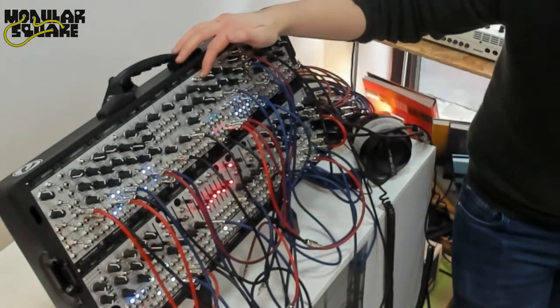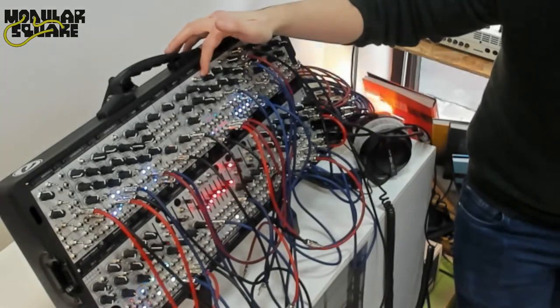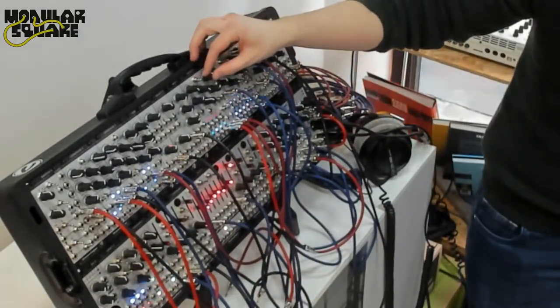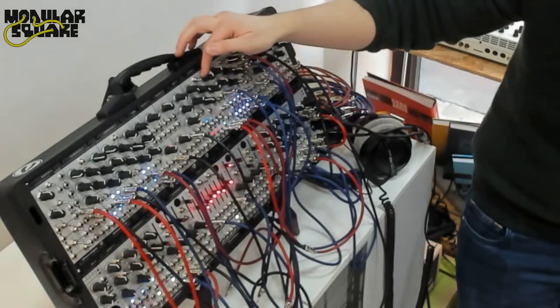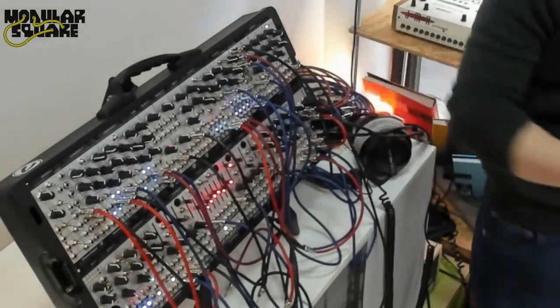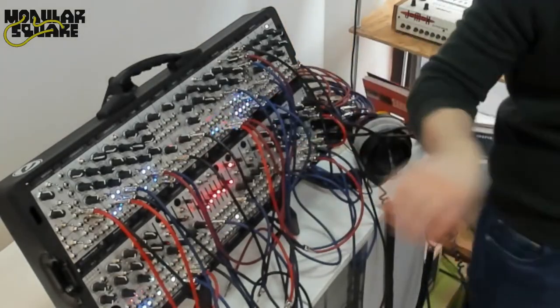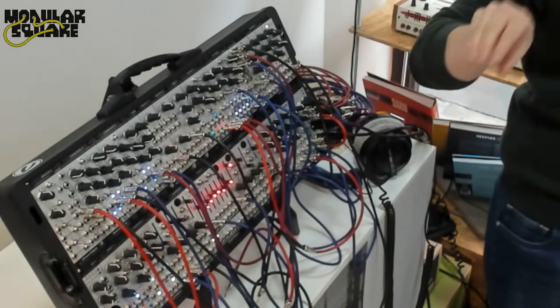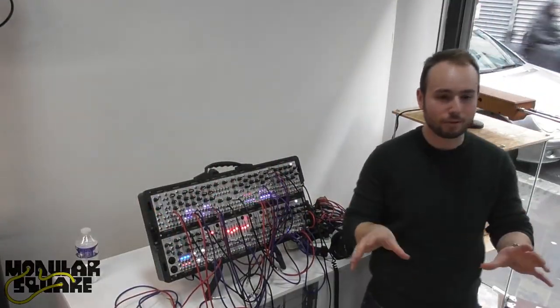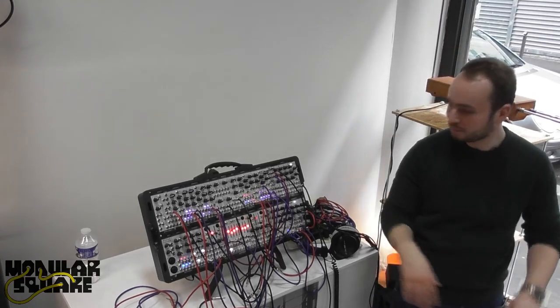And the oscillations you will see on the output. So again, we are self-oscillating here, and I'll remove the input. All of these are in an 8-phase relationship. So we have 45 degrees of separation between these low distortion, high stability sine waves being generated. So we have an 8-phase LFO suddenly, not just a filter.